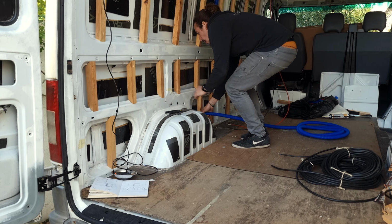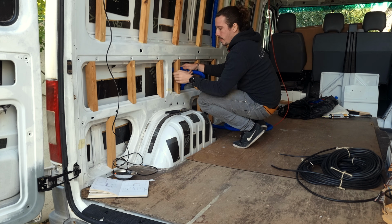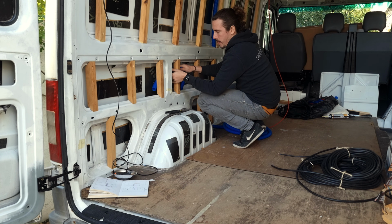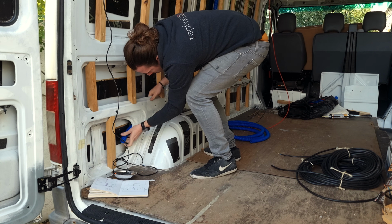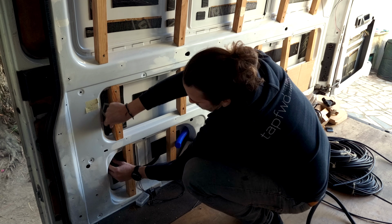At the ground level, the process is also very simple. There are a bunch of gaps in the framing that we can use to pass the wires. So we're just gonna use conduit to keep everything neat, tidy, and protect the wires from chafing in the middle, which could get dangerous in the long run.